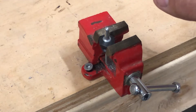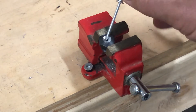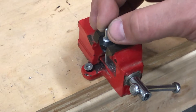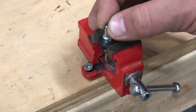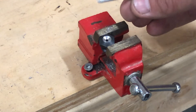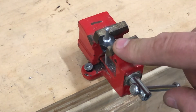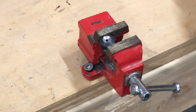Zoomed in here — you can see that the round face of the rivet, once put into this nose piece, is about the same size as the diameter of the rivet. If you had machined the hole too deep, it's not the end of the world, because all you'd have to do is file the nose piece flat, which would then bring the dome part back up to flush. There you go — the machining of an A5 tip for an air riveter for a Zenith aircraft.